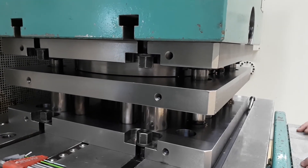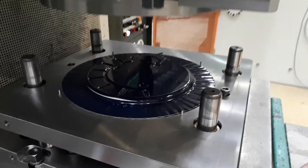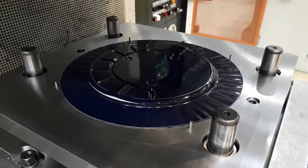For this purpose, the so-called forming limit curve — a measure of the formability of the raw material as a function of strain state — is reduced in accordance with the forming capacity which was already consumed.